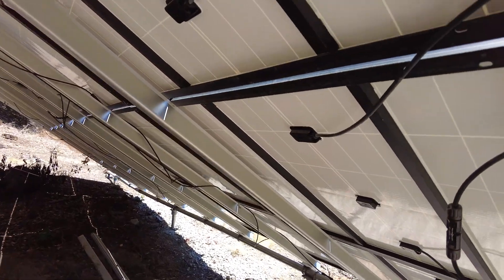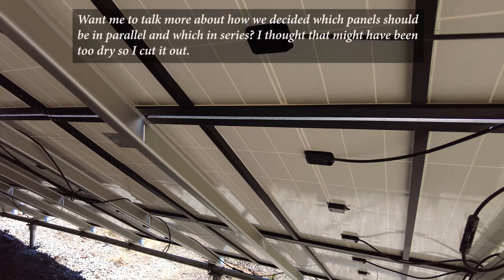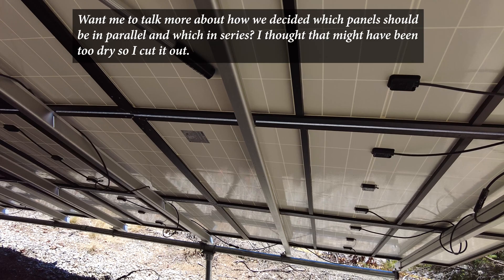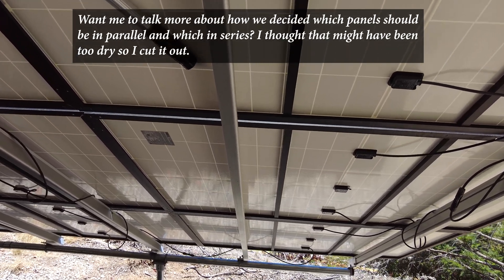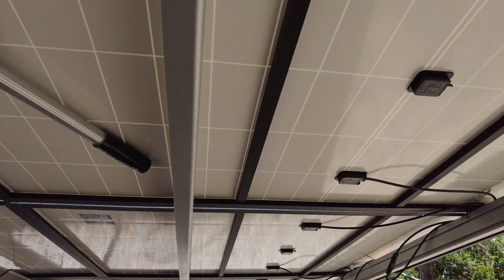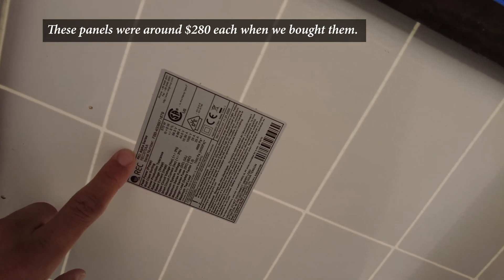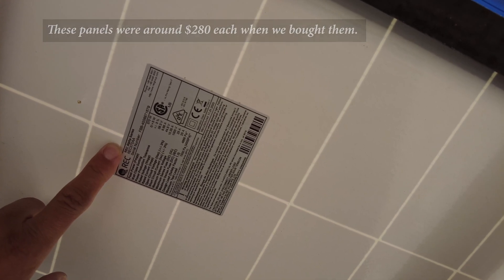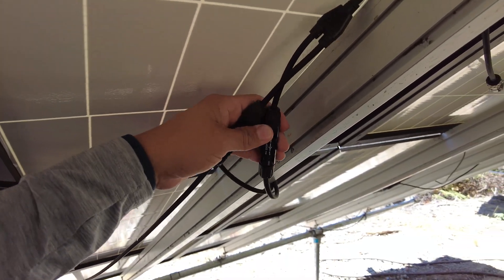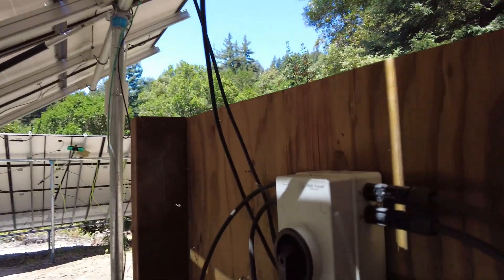There's a bit that goes into the way the panels are interconnected because these are two sets of panels in series — 10 panels in series — and then those 10 panels are paralleled together to create the appropriate DC voltage output for the Schneider inverter and charge controller setup. These are REC 370-watt split-cut solar panels, and they combine together, and at some point you'll see a Y-connector that connects the two paralleled banks together.